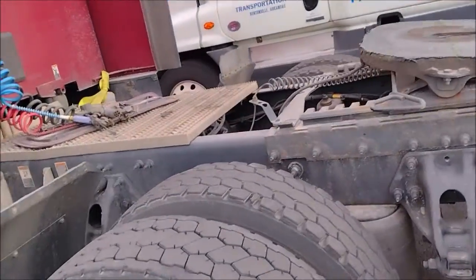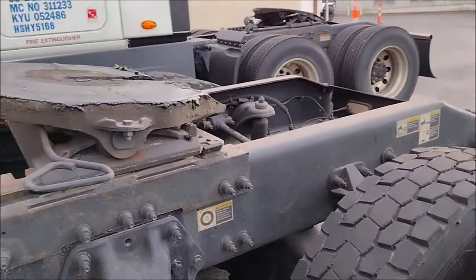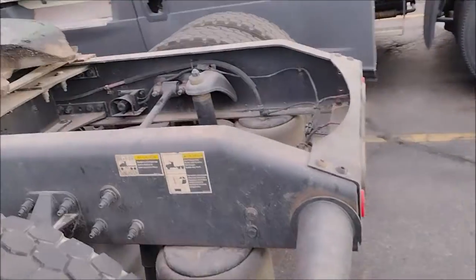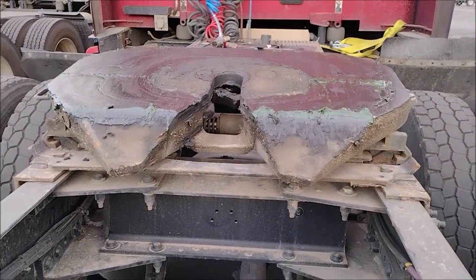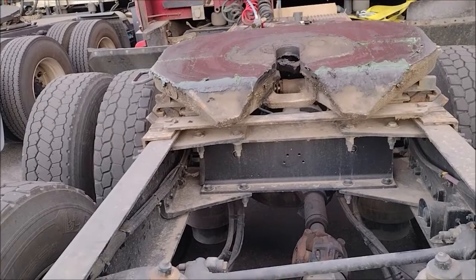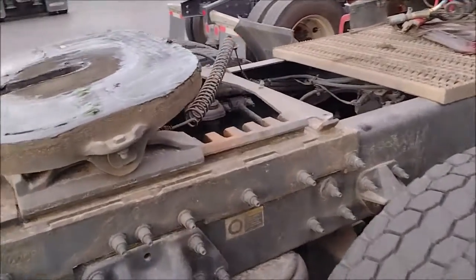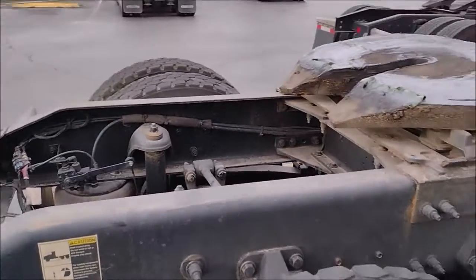This is a different kind of fifth wheel. Look at the side. You can lock and unlock it, it does have a latch inside, but you have to do it manually. If you look inside, you can see the pneumatic piston. So you can slide it pneumatically by air, but you cannot release the kingpin by air because it doesn't have a piston for the kingpin. That's enough. It has enough grease on it.